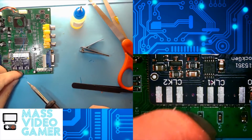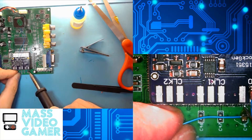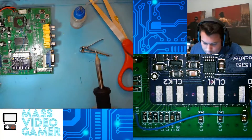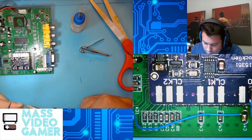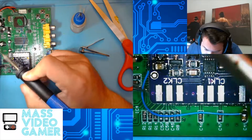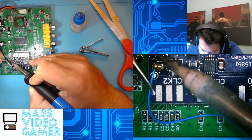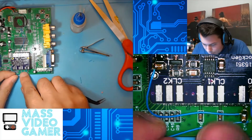That wire will go all the way to the capacitor on the actual clock generator board. I've fluxed it up, already tinned my wire, and I'm going ahead and heating up that side of the capacitor. I've already cut it to length. We're going to put that onto the capacitor itself. If you're facing this way, it's the top part — the left part of the capacitor — or if you have the board with the inputs facing you, it'll be the top part. Just flux it up, heat it up. I've already got that tip tinned on the wire. Use tweezers as the Kynar is rather stiff wire so it might fight you a little bit. I'm still keeping my iron around 300°C because I don't want to burn any pads, and you don't need a lot of heat for this. And there you go — that's in.